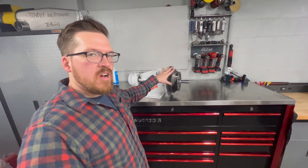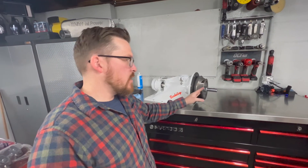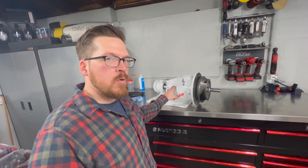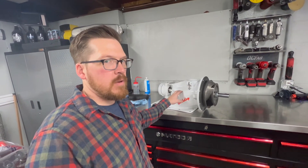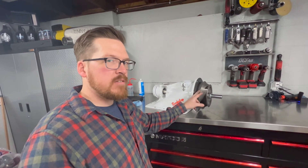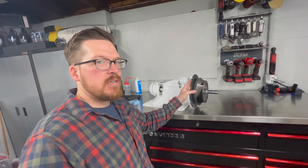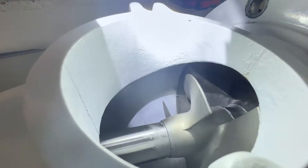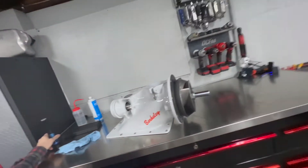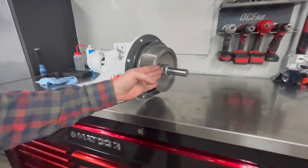Everything is installed and torqued. What's really important is you need to check that your impeller sits where it was before and that you have enough clearance at the back for the bowl. This pump was used in a race boat years ago and they tightened up all the clearances quite a bit. Before I sent it out, I had about 35 to 40 thousandths of clearance from the front edge of the impeller to the suction housing. Now when I look in there, it looks to be about a quarter of an inch - it's moved everything rearwards quite a bit.